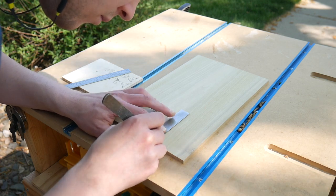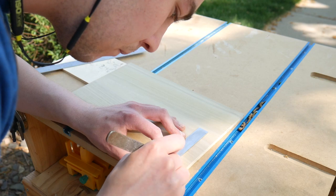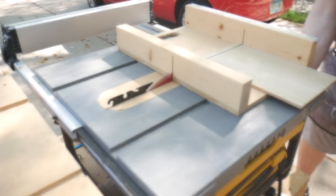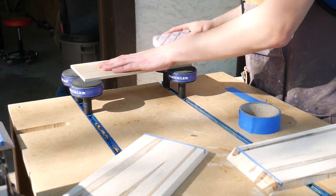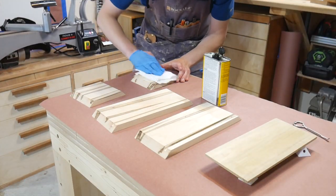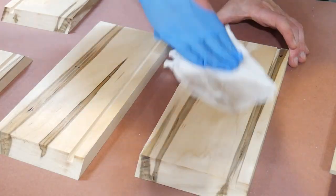With the miters put on, I could then measure the inside lengths plus the groove thickness in order to get the correct dimensions for the bottom, and I transfer these onto that piece and cut it out on the crosscut sled. Before assembling and gluing up, I want to do a nice sanding and finish of the internal parts because it'll be hard to get to later. I put some tape over the inside corners next to the miters because those will reveal a gap if there's any discrepancy in the thickness. After sanding to about 220 I apply some tung oil — just one coat on the inside surfaces.